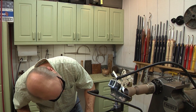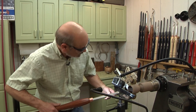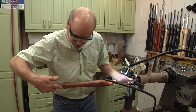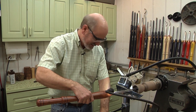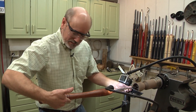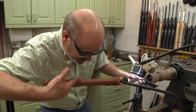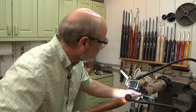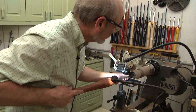I'm going to turn this on. We've got our steady center back up again. Pick up our speed — you can actually see in there. I'm having a hard time because it's like got an octopus in the way here or something. Anyway, bring this in. This has to be perfectly level or you'll get in trouble. Now one thing when you're hauling, don't step on the emergency stop. There we go, kick that out of the way. We'll just go until we hear it touch.